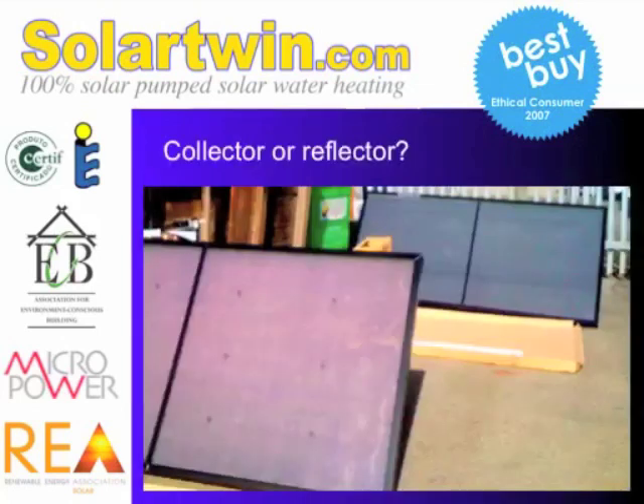What we've developed as a prototype is a thermochromic solar collector. At the front is a thermochromic one which goes pale when it gets hot. Instead of being black and absorbing heat, it reflects it. I've shown you the picture of it halfway through transition — when it gets really, really hot, it goes white. So we've got a sort of greyish one there.